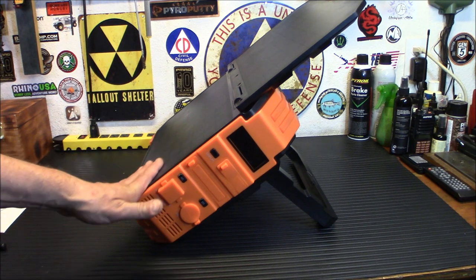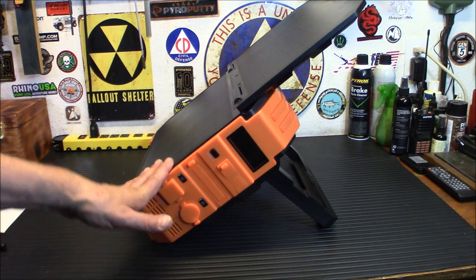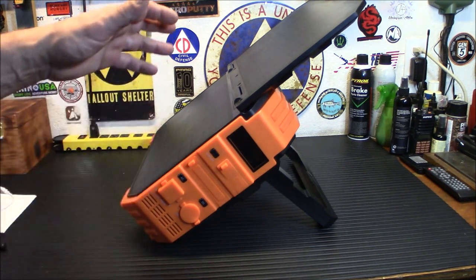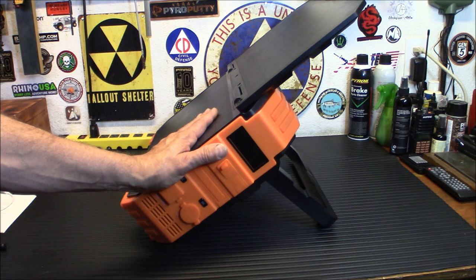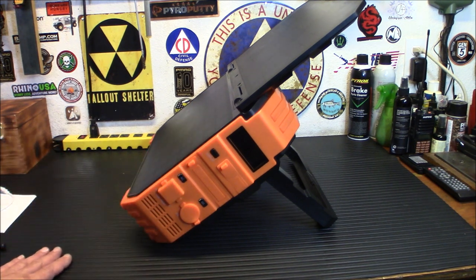What I'd like to tell you about is the LiFePO4 battery. Lithium iron phosphate batteries are far superior — this one will stand up to 3,500 cycles, and even after 3,500 cycles it will still maintain about 80% of its original capacity. You also have an advanced battery management system that monitors things like over and under current, short circuit, and more. It's a very safe unit, and LiFePO4 batteries are a whole lot safer than lithium ions that can catch on fire easily. You get a 60-month product warranty, and the company has been very responsive and easy to deal with.